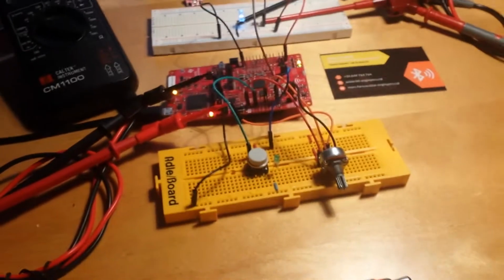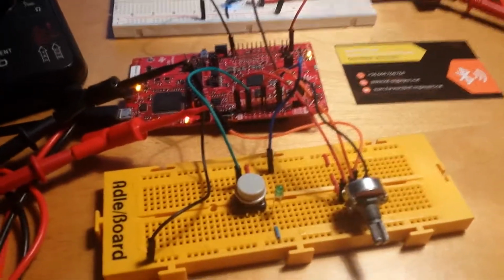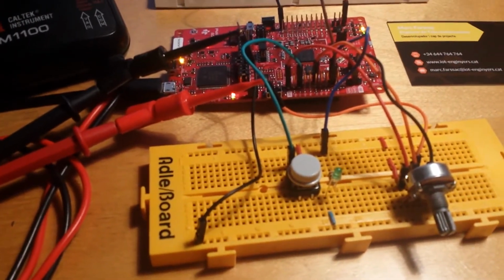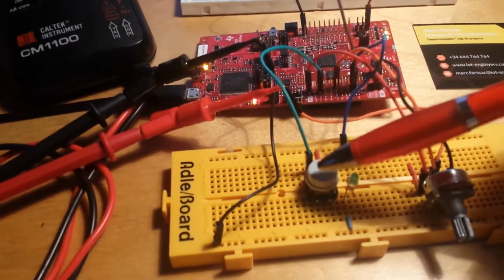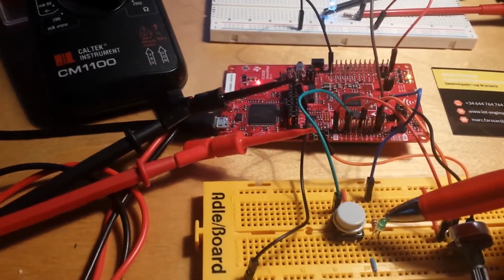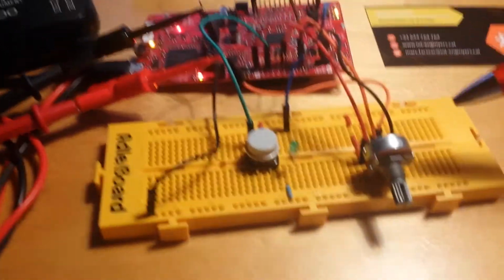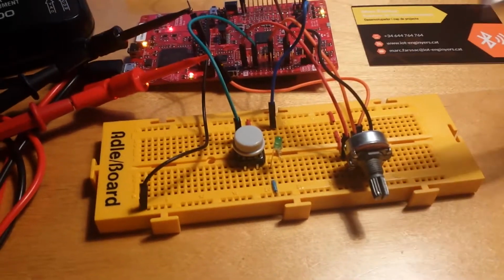The architecture is the following. We have a real-time operating system, a firmware running 2 threads, one for reading and one for writing, a callback for the calibration push button, this one here, and a general purpose input-output to turn on the calibration LED. Instead of the temperature sensor, we will use, as I said, a variable resistor and calibrate the readings.